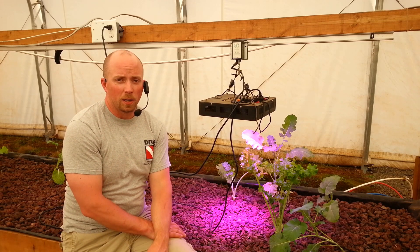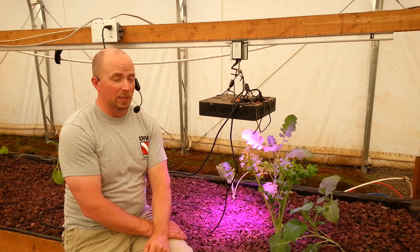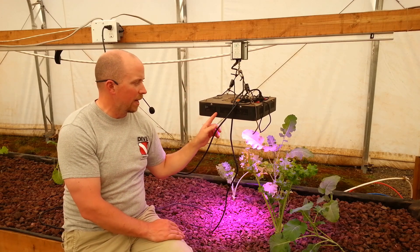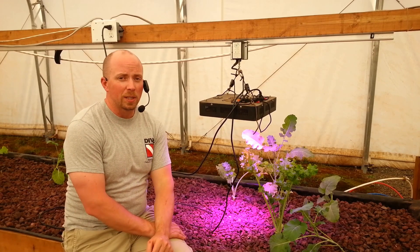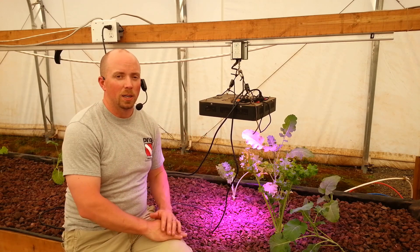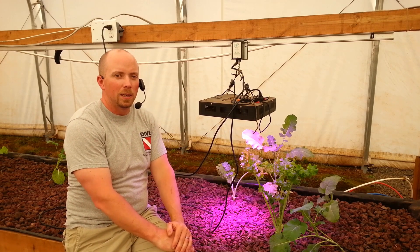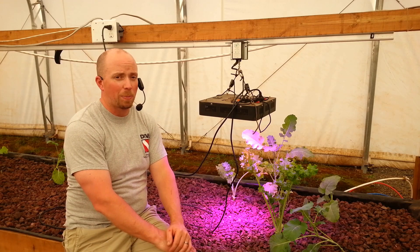I believe it's time to start talking about a custom LED solution. All other light types take too much power — they're off the table. What we should do is have a single static light, get rid of the motor, and get rid of all the excess components that come in normal small-space LED grow lights. I'm thinking a reflector back with a series of LEDs down the middle, mounted on aluminum bars or thin aluminum plating, maybe with fins on the backside for heat dissipation — but no active cooling, just totally passive cooling.